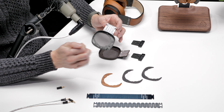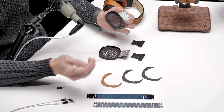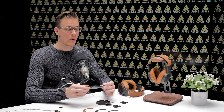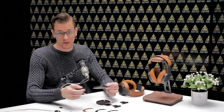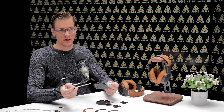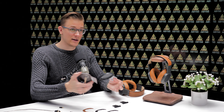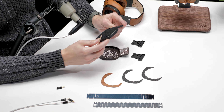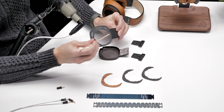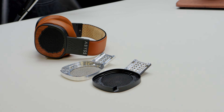One of the things I was really pushing for on Diana MR was to reduce the weight of the components while also retaining good manufacturability. We've made many thousands of Dianas at this point, so we have pretty good experience manufacturing roughly this geometry and style of part. And with that, it allows us to leverage this experience to do things that might not be very economical for other people to do — we can push the tools really hard when we know we can get away with it. With this part, we did a lot of creative machining to reduce the mass so that this part is lighter than the regular TC frame, even with the insert loaded in it. You can see all these holes on the outside edge of the part — they actually get blocked by the insert that goes in here.